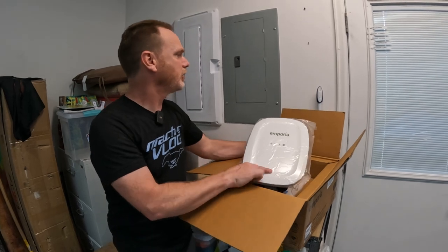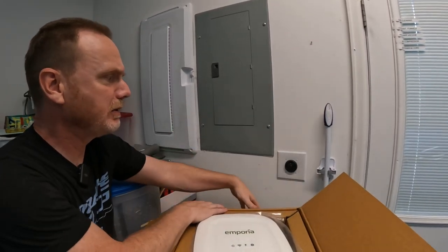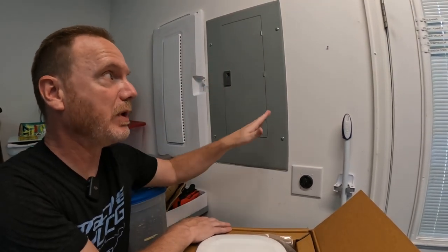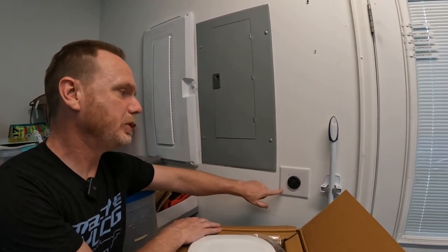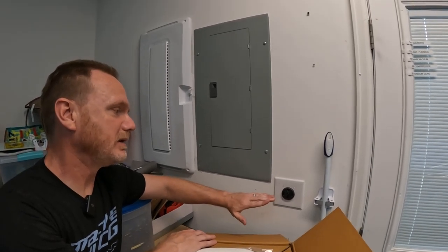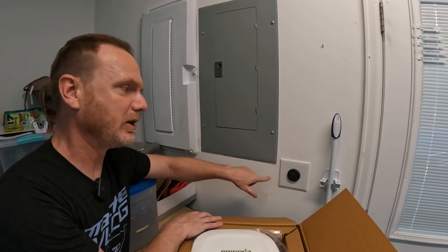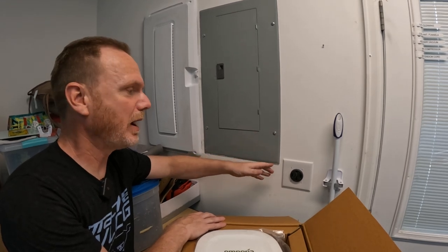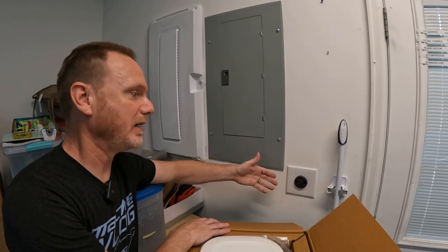We need to get this installed. There's the outlet we're going to install it on — we're going to mount it above that. This outlet is actually relatively high; I would recommend doing an outlet a little bit lower, because the charger will end up higher than I'd want. But overall this is a great installation. What I recommend is to ask for a 50-amp circuit with a NEMA 14-50 plug — this is the standard you'll see in a lot of RV parks and what most Level 2 home chargers support. Some electricians will say you can get away with 8-gauge wire, but I would go with 6-gauge, because you're charging for so long it builds up quite a bit of heat, and 6-gauge wire handles that a lot easier.